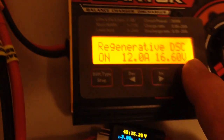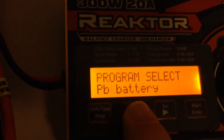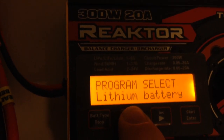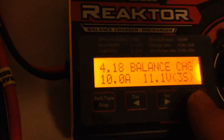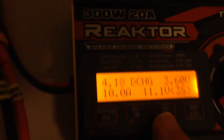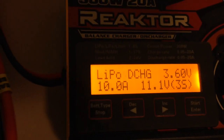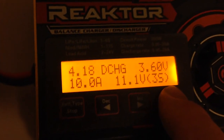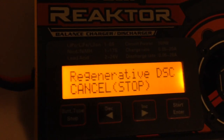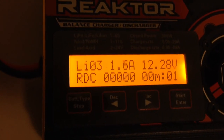So let's start the process. We need to go back to settings, then back to the LiPo lithium battery setting, press enter, and go to discharge again. Here you can set the discharge rate — I've got 10 amps set. The unit also has the 12 amp limit I set previously. So let's hit discharge. It will ask you to confirm — that's a safety step. We confirm yes, and it will do the regenerative discharge. Takes a few seconds and away it goes.